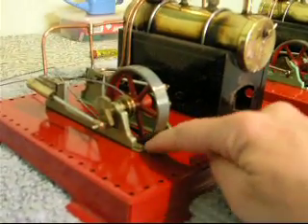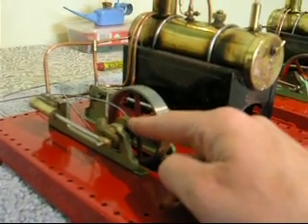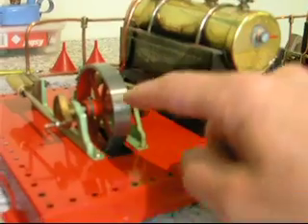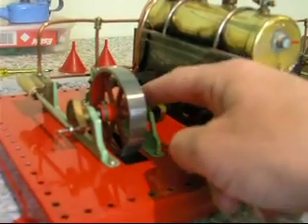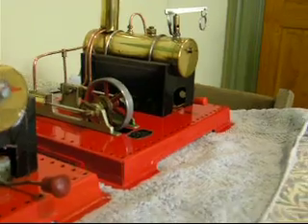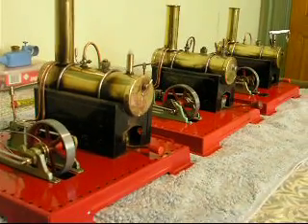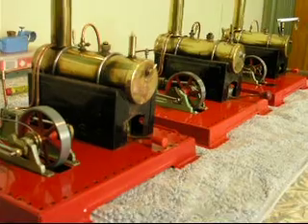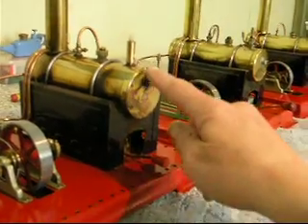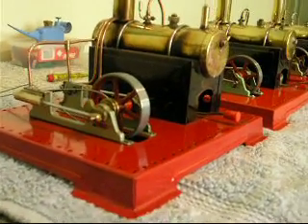This particular engine has a riveted engine frame and curiously a smaller size pulley on one side with a plain side opposite. Whereas on the 1957 one, you've got a grooved flywheel as well as a larger pulley, and on the Griffin and George version, a much larger pulley again. These little features tend to vary throughout the lives of the engines. Overall though, the SE3 changed very little. It's only around 1976 that you had a hard solid fuel burner, and then the very last ones from about 1978 had a sight glass on the back — you don't see a great deal of those around, so if you're into collecting variations, it's one to look out for.